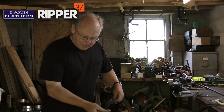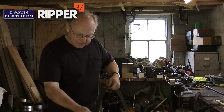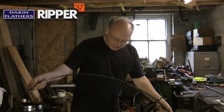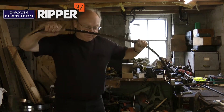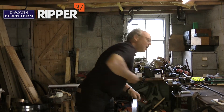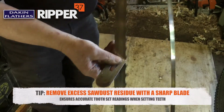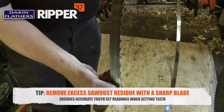There's a bit of build-up of sawdust on the blade, so we'll clean that off. Typically the sawdust gets built up on the inside of the blade, so the first thing we do — which we have to do anyway — is to invert the blade so that it's inside out. You can easily get the sawdust off by just running a little sharp edge or blade around.